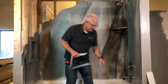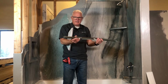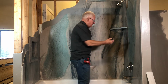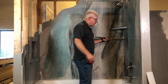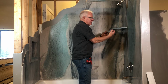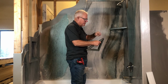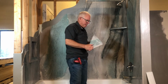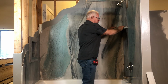So let's talk about our shelves here. This is a 2-part shelf, and you're going to receive the frame, the bracket, just like that. It's got pre-drilled holes where this will go into the corner, and it gives you the freedom of driving the screws in there. Then this arm will bend over, and then this tab bends over like that. Now, I really like using a self-tapping screw to lock that arm in place. And once you have that, then this clamshell will go right over the top of it. And if it fits, it's tight.